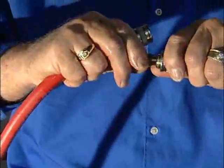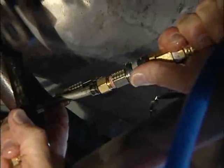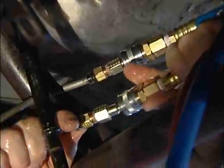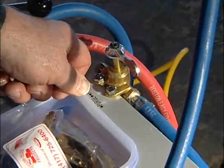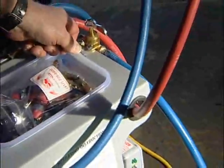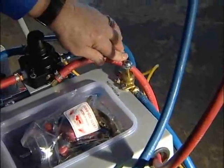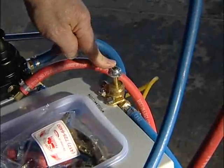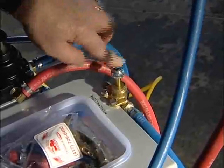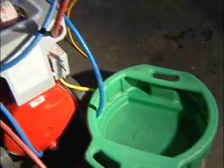Remove the hose connector to prepare the hoses to connect to the cooler lines. Hook the blue line to the inlet line of the transmission cooler, and hook the red line to the outlet line — this is position two and one. We're going to be flushing backwards, doing a back flush, to get the first really dirty oil out of that cooler. We don't want to blow air through that cooler line because that simply pollutes the atmosphere. Make sure that the needle is pointed to the blue hose and that the blue hose is in a good oil receptacle. Now we're ready to go.